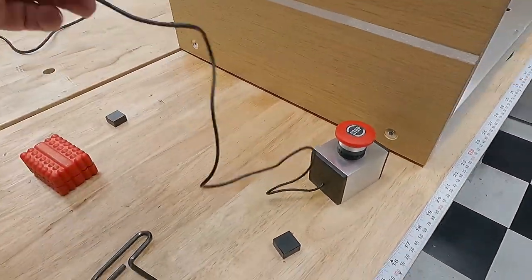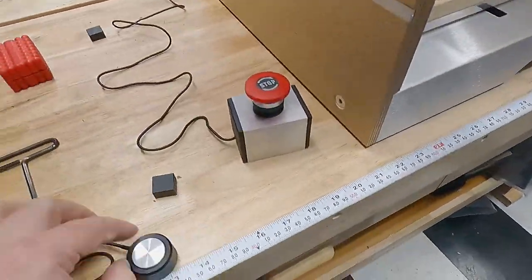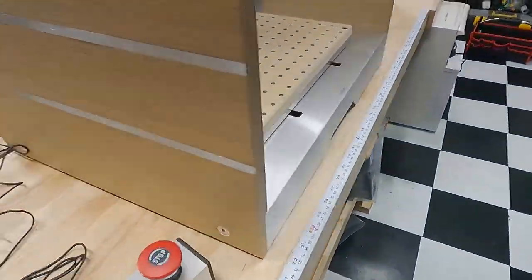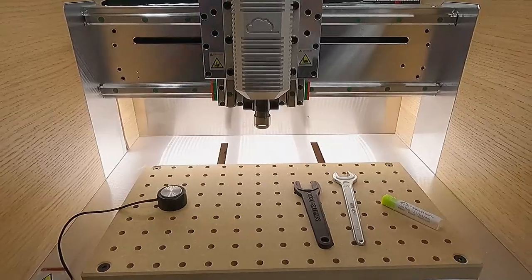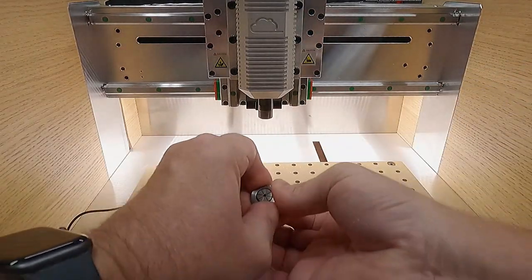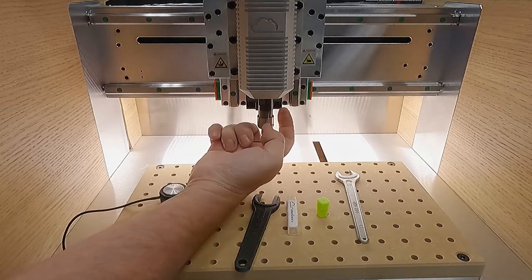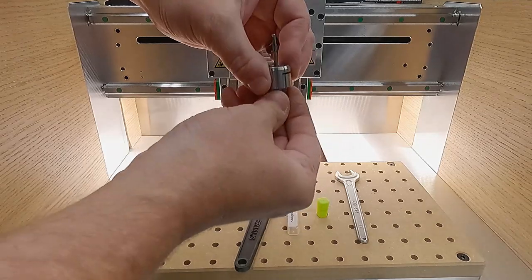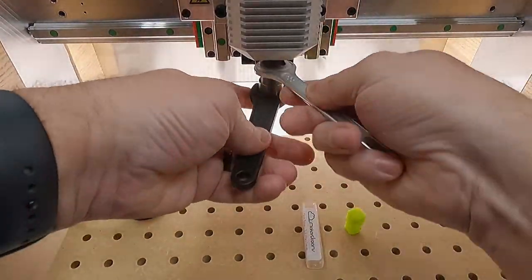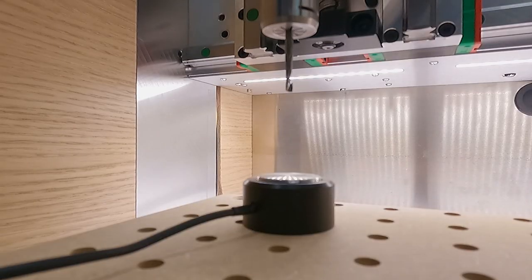For the E-stop, they've all got these little 1/8 inch headset plugs that plug right into the back — clearly labeled for which plug to use. The touch probe also has a headphone jack right next to the E-stop, and that's used for our Z probing. Now changing the collet — this collet has a unique wrench with a couple slots, and the spring collets go right up inside there. They don't snap in like some chucks do. It's a little backwards for me — I'm used to tightening the collet chuck, but in this case it's easier to tighten the neck. All my other machines are the opposite.